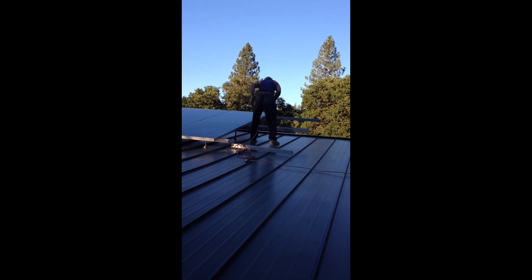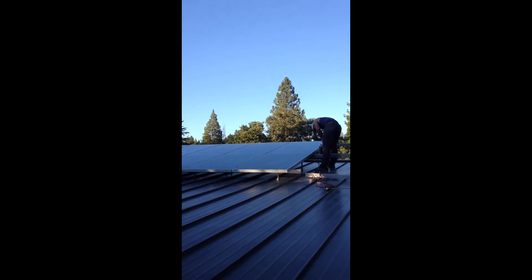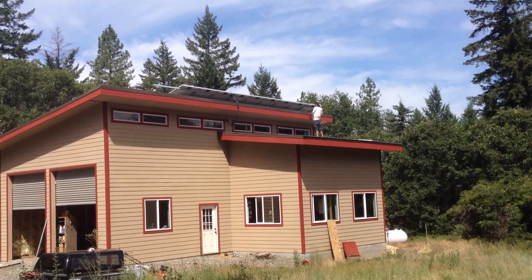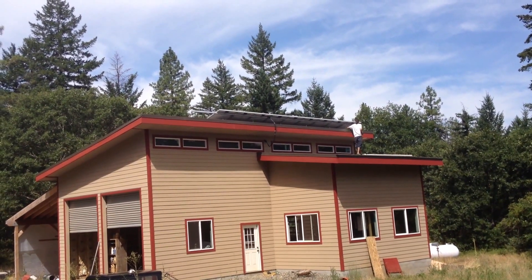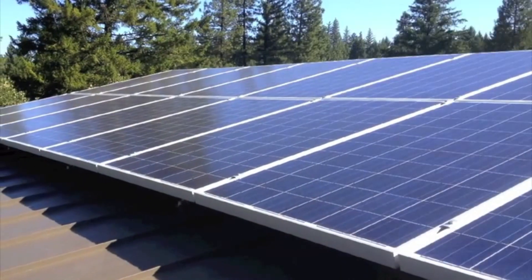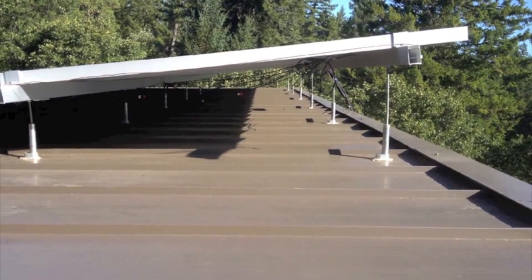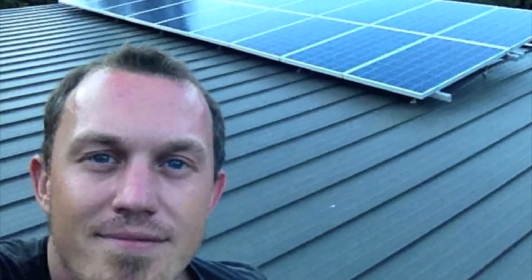Cutting off the extra rails because they stick out a little too long. Leo's putting the siding on right now, making it look pretty. We've bundled all the wires and we're going to tuck them up under the roof there. Here the panels have been installed — we have 18 230-watt panels for a total of 4.1 kilowatts. These have been wired in strings of three panels each, six strings total, and they've been tilted at 15 degrees facing south-southwest. This is the completed mounting and grounding to the rail, and as you can see, I'm very happy about it — it looks nice.